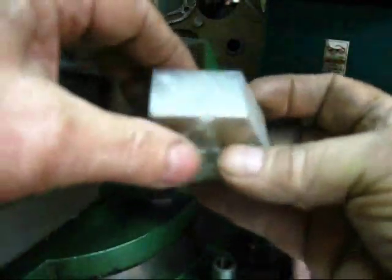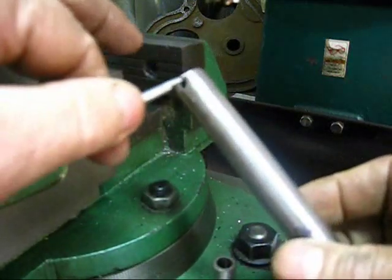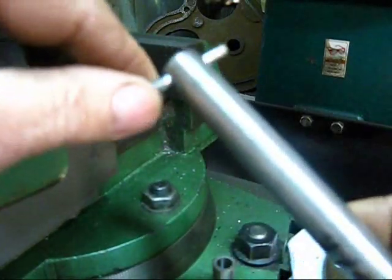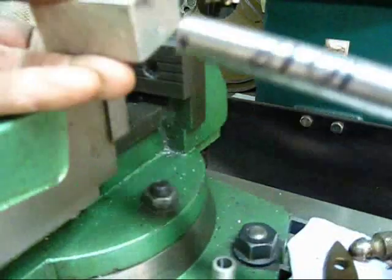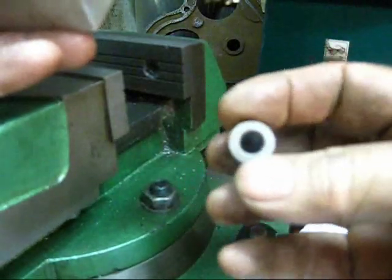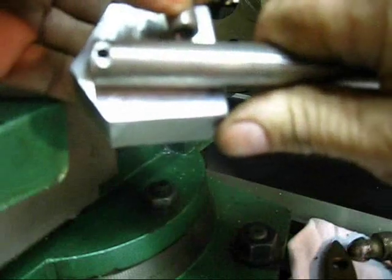I've got this piece of aluminum, just out of the junk box — it was a rim I picked up somewhere in the past. The project for today is I need to make several shafts that have a cotter key hole in the end. So I need to make a jig to cross drill a hole in this round stock. I'm going to put the hole in the side and then put a drill guide matching up this way.